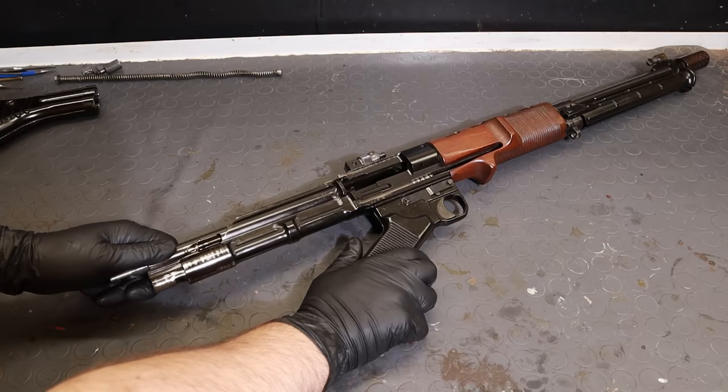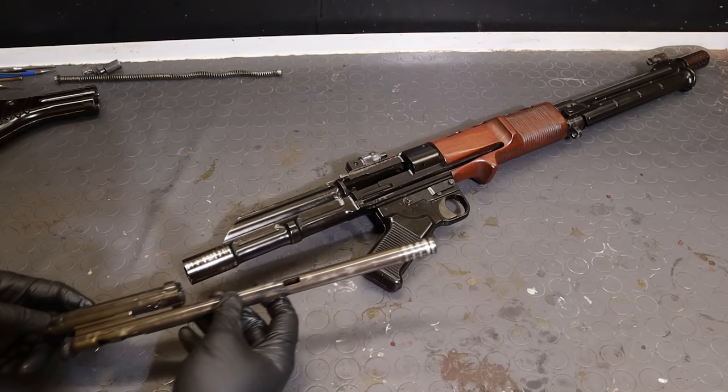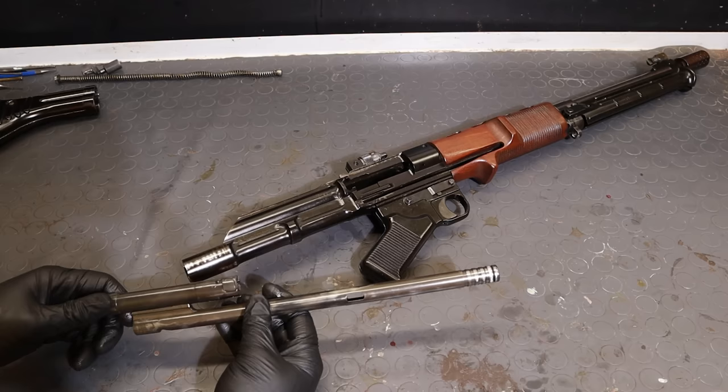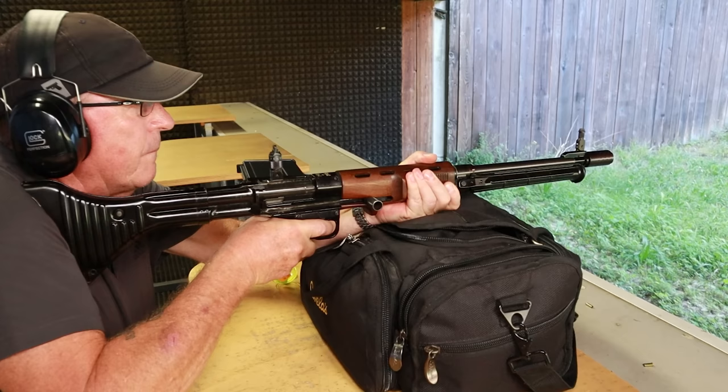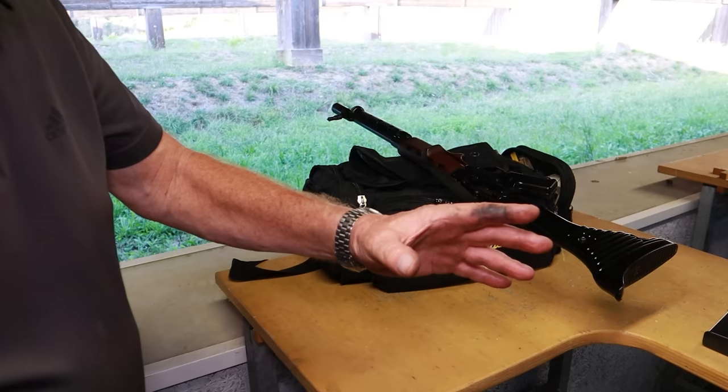Now, the trigger group should be sorted, but I haven't told you how this thing works yet, which is quite remarkable. Let's put ourselves in the shoes of the German engineers once again. Given the weight and size of the barrel, and with only a handful of inches and a couple of pounds of material to spare, they needed a miracle to make the gun work as intended. The self-loading capability is obtained through the use of a gas system placed under the barrel. The gas piston also acts as bolt carrier, kind of similarly to the AK-47. To keep the reciprocating mass low, the piston was made as short as possible, therefore having to spill gas from the barrel quite close to the breech. Holes on the gas cylinder allowed excess gas to be vented out after the piston had gathered sufficient velocity. This wasn't the most comfortable thing to do though, since the gas vents are placed right where the hand of the shooter is.